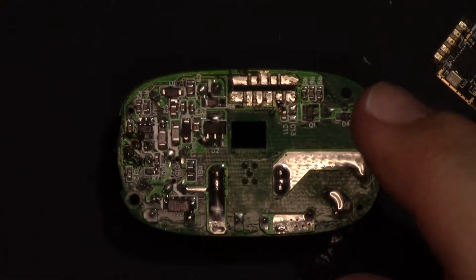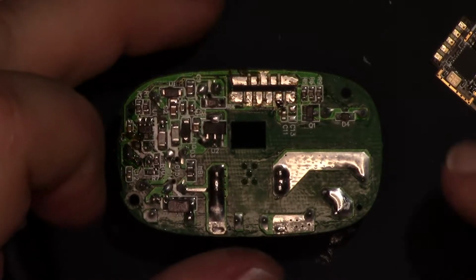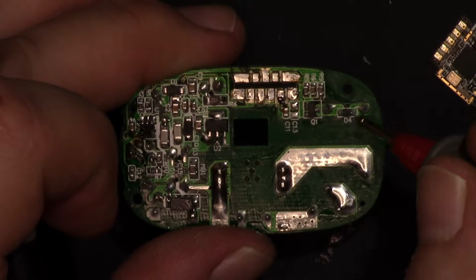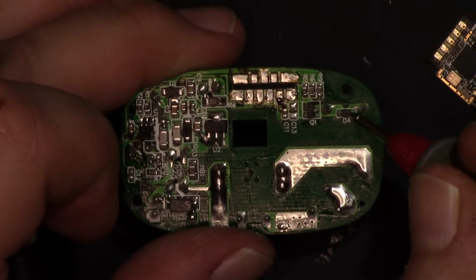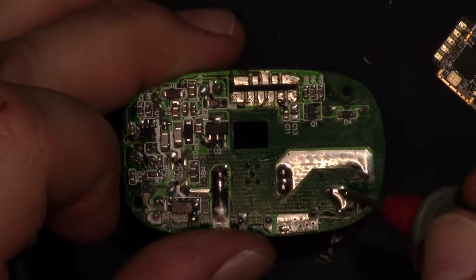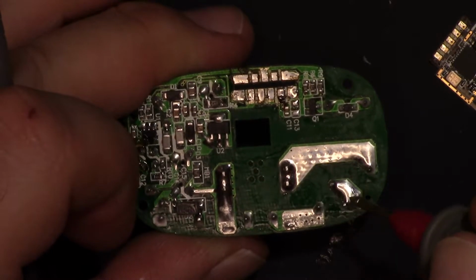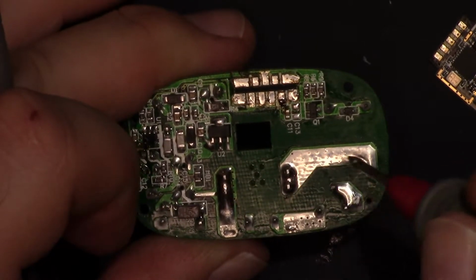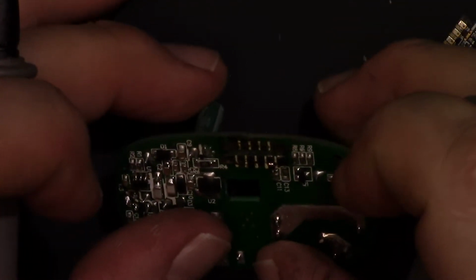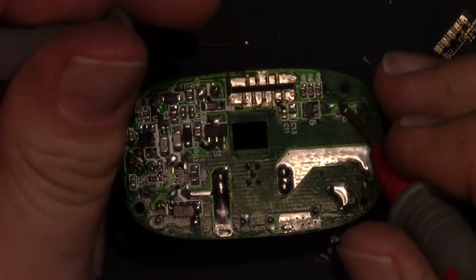Quite a bit. So the output to the relay is going to be controlled by this transistor here. This is our reverse pulse protection diode that goes across the coil. And this is our switching contacts with the fuse. So the power comes in here, goes through that fuse to the one contact, then out when the relay is closed. So that transistor is going to be driven by the controller.